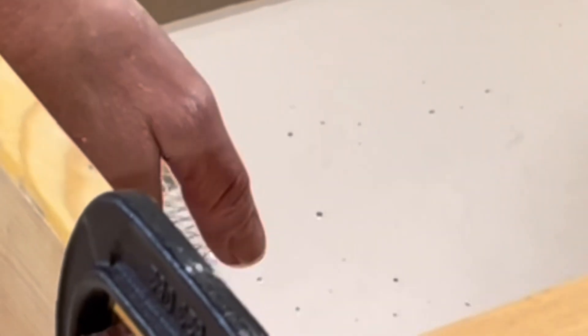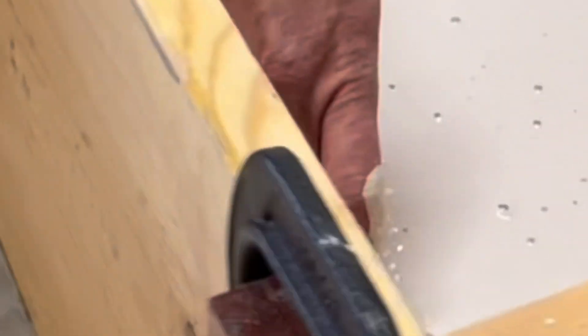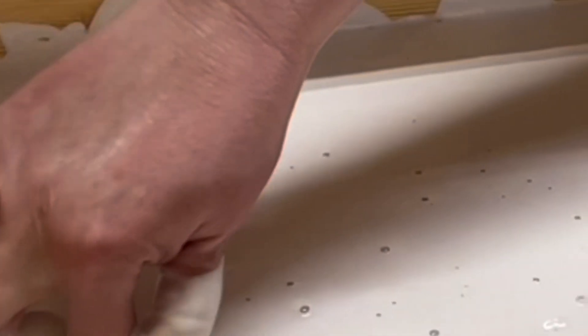Our mesh is ready. This is just going to make one mold. We're placing the hardware mesh into the plaster — we'd rather it be poking on the bottom than on the top if we can. We check the thickness and dump the rest of the plaster in. So that made one mold.